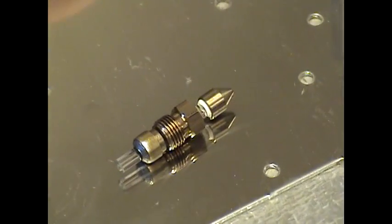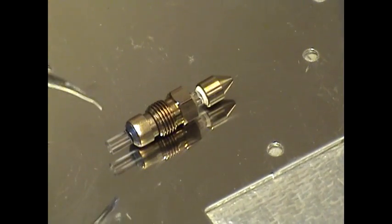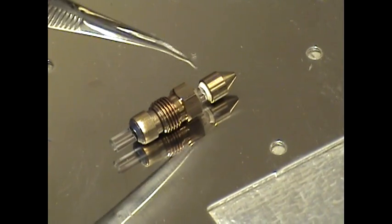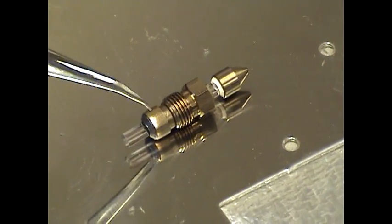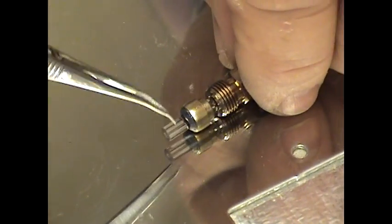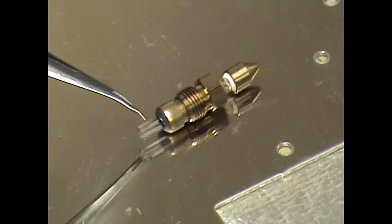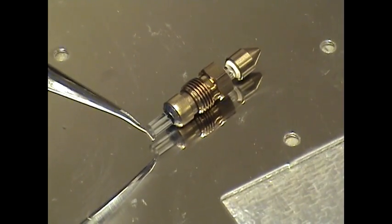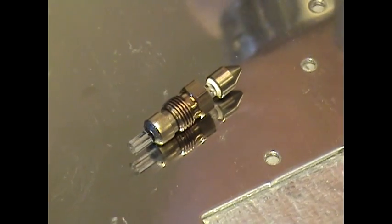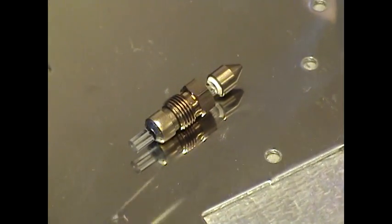Something to note: if you replace a new jet, note the old one — the distance between the bottom of the quartz tube and the top. You'll want to slide the graphite ferrule up or down to give you the same dimensions from the bottom of the ferrule to the bottom of the jet, and also at the top. If you have a question about that, read the manual. It'll tell you the exact measurements that things should be at.